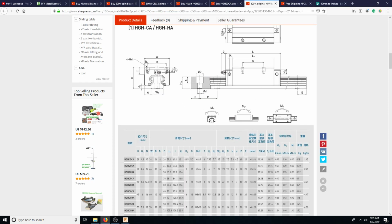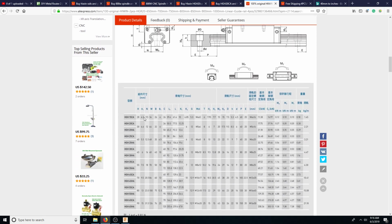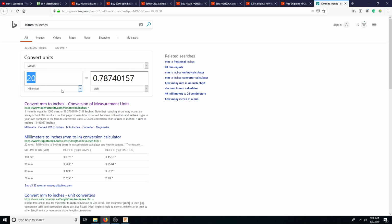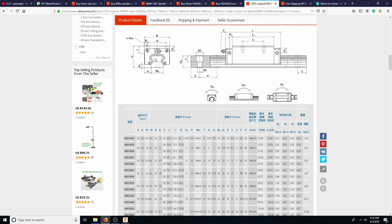And then what about the height? Height of the rail. You don't get the height of the rail? I mean, it's basically H minus T. It's about 22, pretty close to 22. This is about 0.8. And again, we want to minimize that. We want this guy to be as close to here because then there's going to be less torque on it.